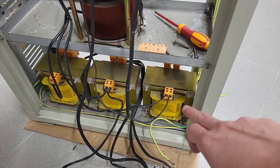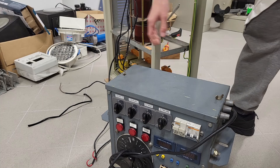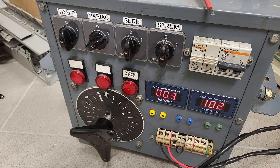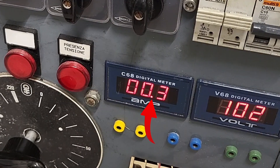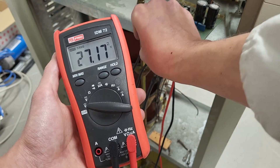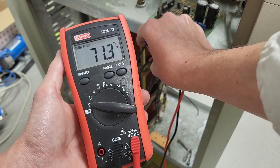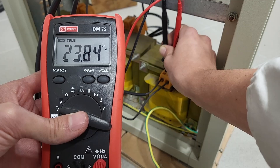I've now made some temporary connections to test the first variac and transformer to check if my schematic makes sense — and what better way to test a variac than with another variac that I built myself! The current drawn by the variac with the transformer is just 30 milliamps, so it looks good. Feeding the variac with exactly 100 volts, I check the output: on one side it's 27 volts, on the other 76 volts — adding up to about 103 volts. Perfect, it works.